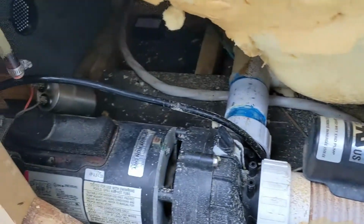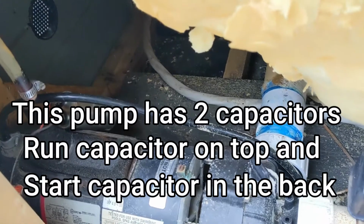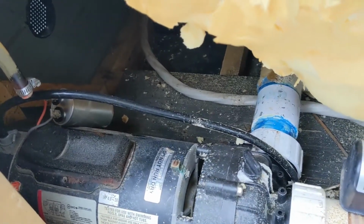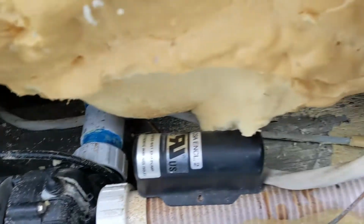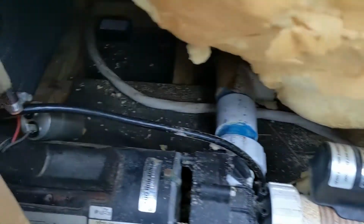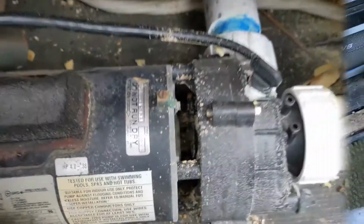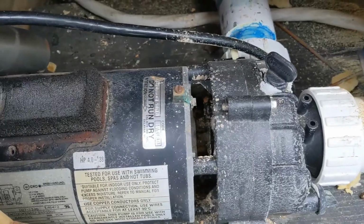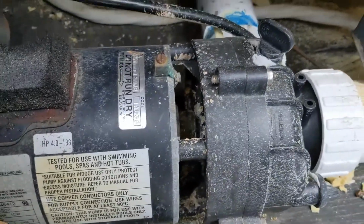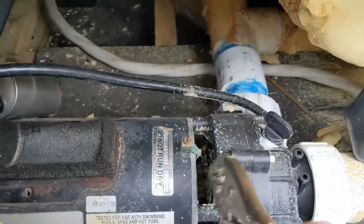So I've tested the capacitor in the back, took the capacitor off, and I'm going to put a new one in right there. I tested it, it was zero. So we have a video on our channel on how to test a capacitor. I'm going to swap this out right now, because sometimes you'll get that hum when the bearing is seized. You can't move the shaft, so make sure you get a pair of pliers in there.